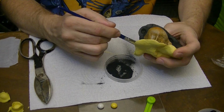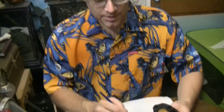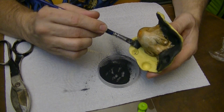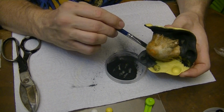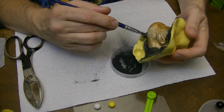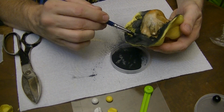And the reason that graphite works well to provide mold release for silicone is because the graphite puts a layer of particles there. And essentially the silicone will try to adhere to the graphite instead of the other material. Now, things like oils and other materials, I think there are other alternates for mold releases for silicone mold putties and silicones in general, but I'm really not that familiar with them, and a lot of the ones that work on other sorts of molds don't work on silicone. So I hit graphite, it worked really well, and I use it most of the time.